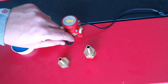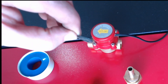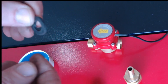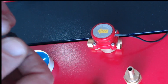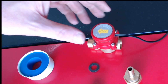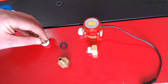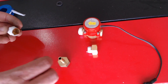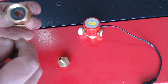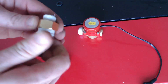Make sure that we don't have any leaks. It is very important to make sure that these O-rings and washers are not perished, not cracked, and are in good condition — we don't want any leaks. If yours come with cracks or perishes in them, just order a couple of new replacement washers. We have thread tape on all three components that are going to be connected together, using these washers. Making sure they're nicely seated and not perished, thread them all together and make sure they're nice and secure.